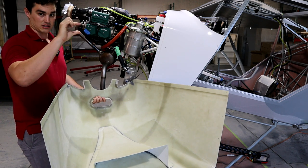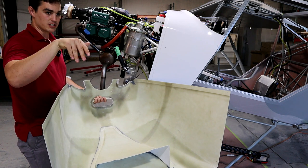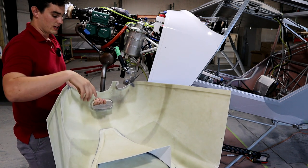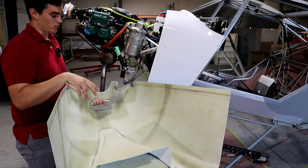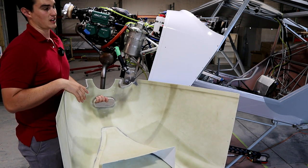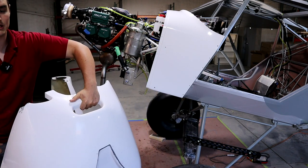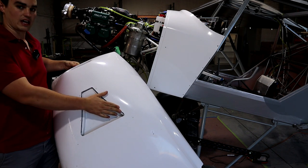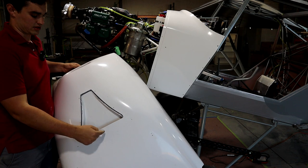We ended up at about five degrees pitched back to fit the NACA duct. To fit the duct, we pulled the fittings out of the oil cooler so it would go right over, cleco'd it in place, drilled number 40 holes on each side to pin it, moved it slightly forward or back, then cut the profile according to the manual dimensions. We smoothed out the profile to match the shape of the NACA duct and glued it in place with a reinforcement doubler — super bulletproof and strong.